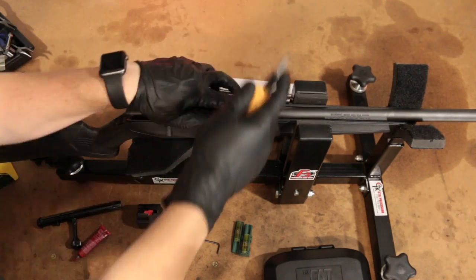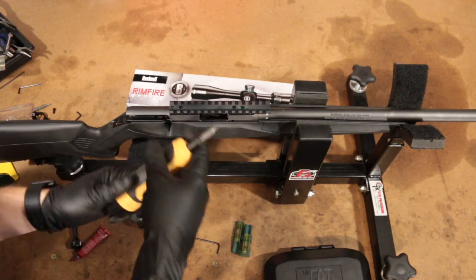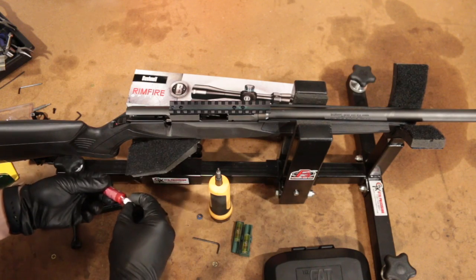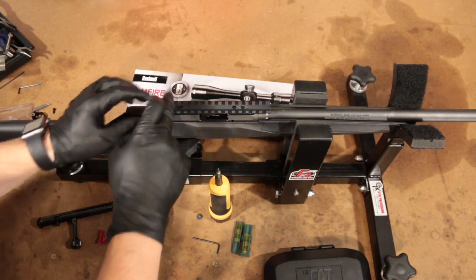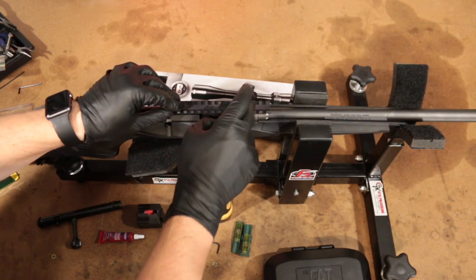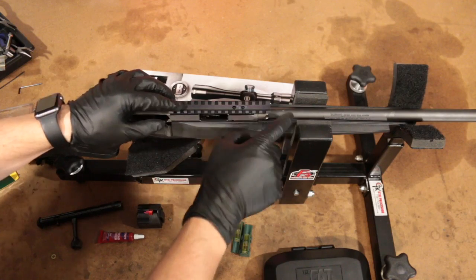Torque it once, twice, 3 times. Torquing 3 times, you'll see some manufacturers actually specifying that. It's not a bad habit to be in. What it can do is pre-stretch threads. It's not an issue with these because they were already torqued in there and pre-stretched, but it also helps to distribute your thread locker in the threads at the deepest point. So torquing it, untorquing it 3 times is not a bad habit to have.